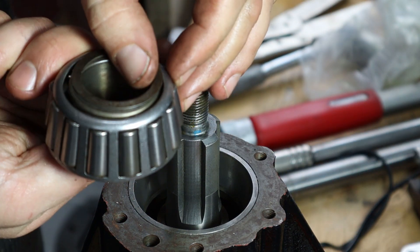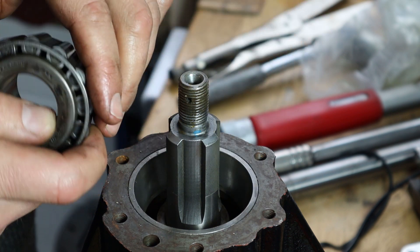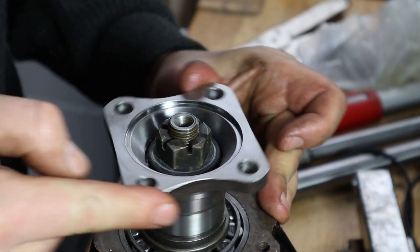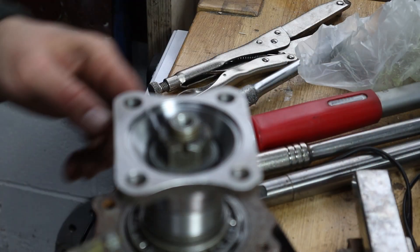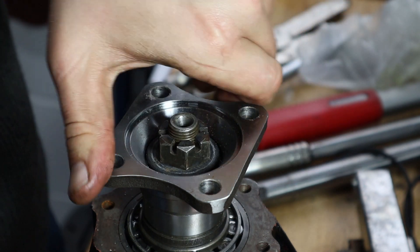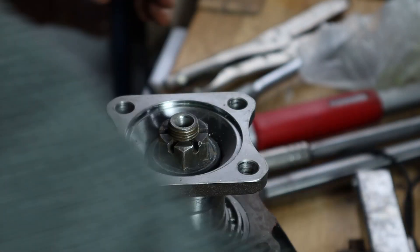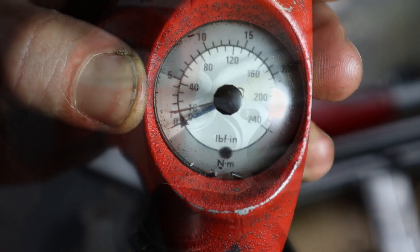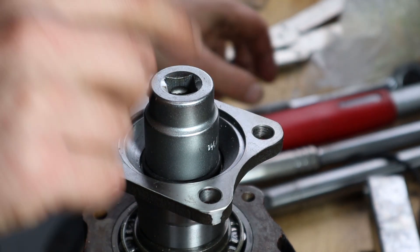Point to note — there's a shim under here that was stuck to the bottom of the bearing, so that needs to go in as well, because that's not what we intended to take out. I'm not at full torque just yet on the nut, but already I'm starting to feel quite a lot of resistance. I'm therefore going to start using a little bit of oil in here — I think that's the right thing to do. We don't want to cause any wear on the bearings. That's all going to drip down onto the other bearing at the bottom. It's important to do a full revolution — it gives me a readout of the maximum, which at the moment is reading 10. I'm happy to go to full torque on this nut.